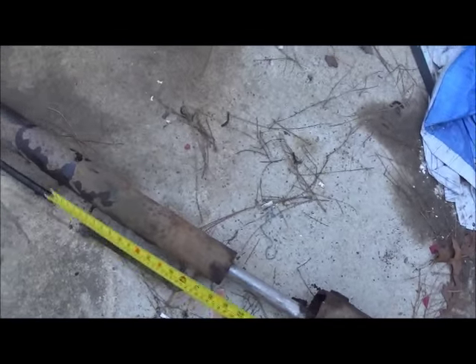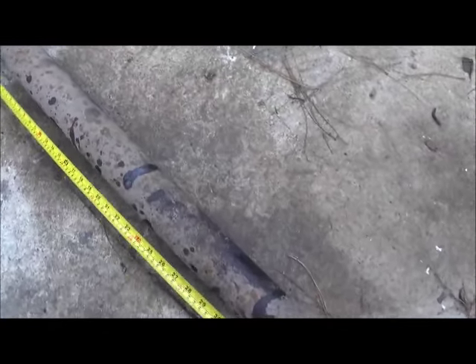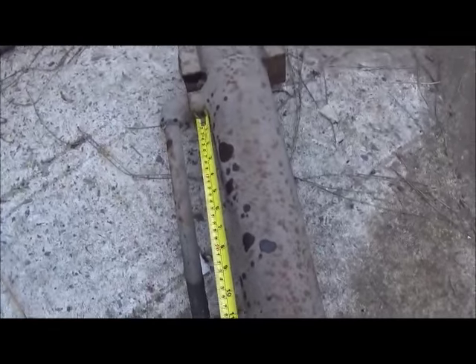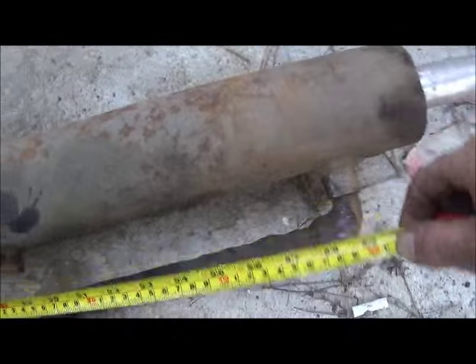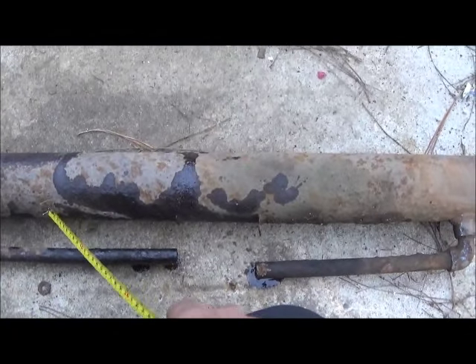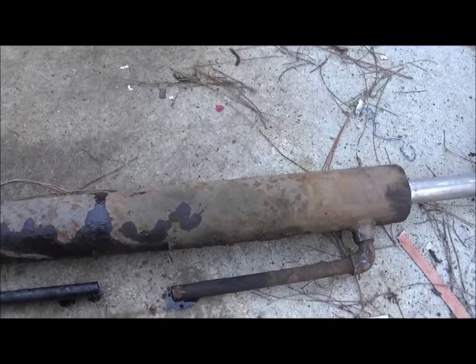When you're checking extensions, it's easiest to pull it all the way out and push it all the way back in. You always figure it's not going to go past your fitting on that end, so we'll go right on this side of the fitting. If we measure all the way to the other fitting, we've got about a 58-inch stroke on this cylinder, and all we need is 39 to 40 inches. I found a few cylinders that were just a little bit shorter than what I needed, but I don't want to go shorter.